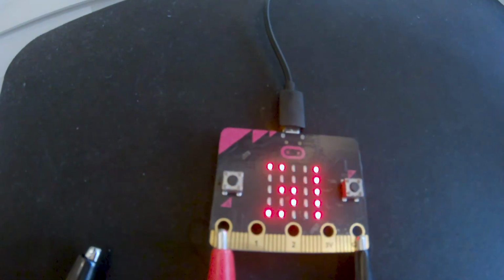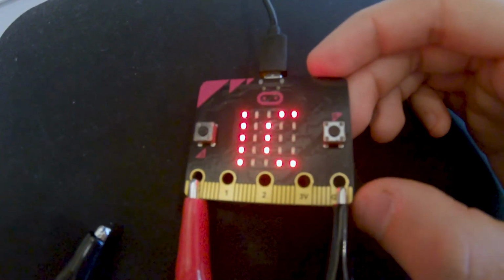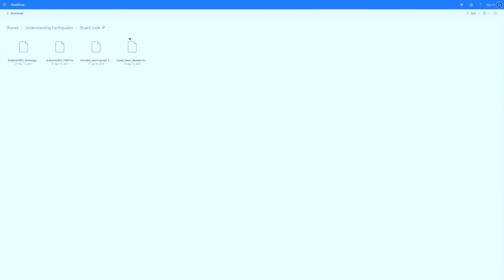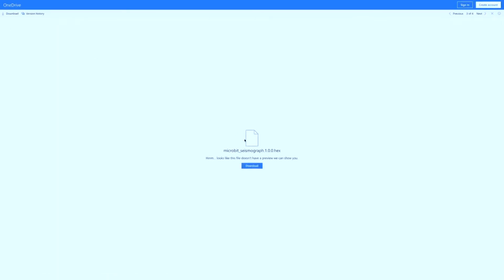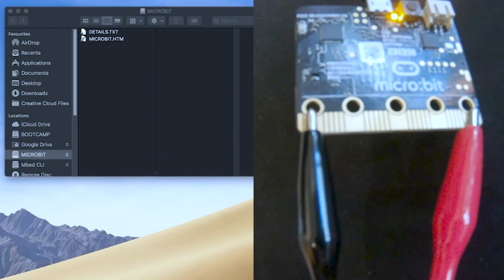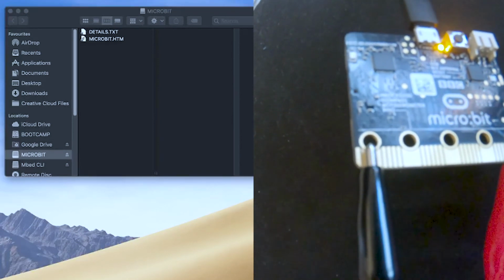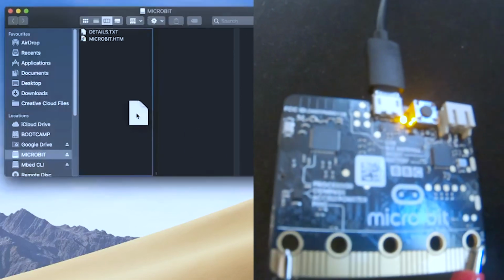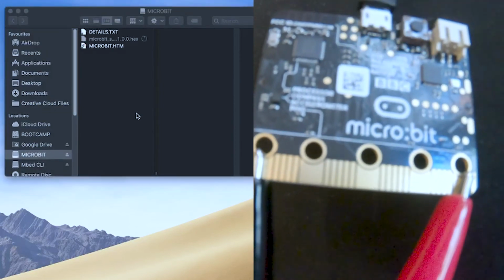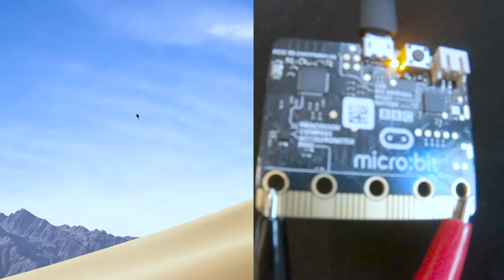while that is happening, we can go over to our computer, and so here is our page where we can download the hex file that we will be uploading to our microbit. I will leave a link to it in the description, and in our case we're downloading the microbit seismograph 1.0.0.hex file, so we can download that. And when we've plugged in our microbit to our computer, it should pop up in our dialog. We can see we can grab the hex file from our downloads and place it in our microbit and let that copy over like so.